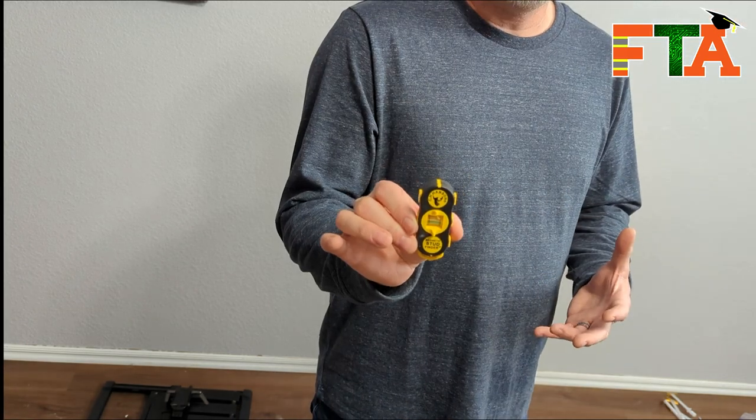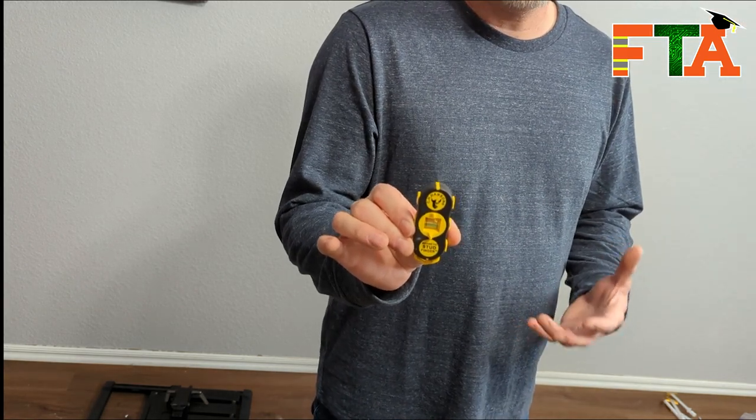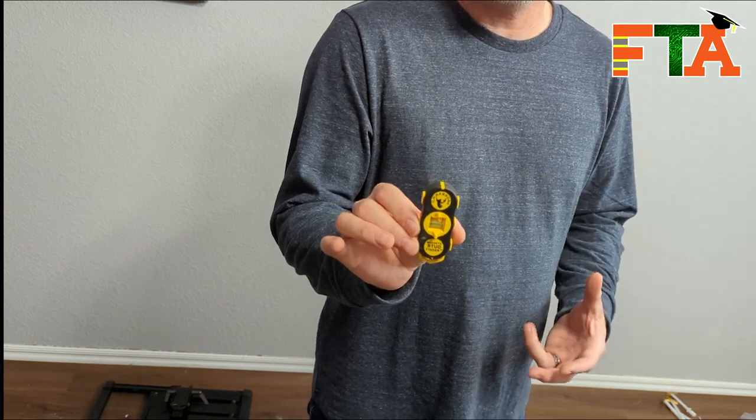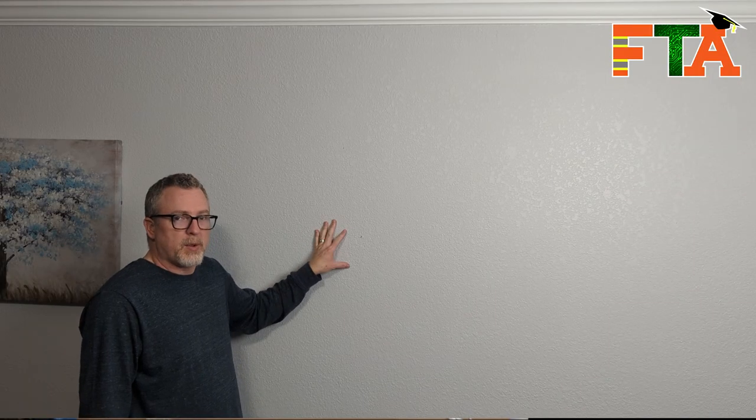So this is a very simple device that I've found. Got this on Amazon. I'll put a link to it in the description. It is a rare earth magnet stud finder. You've got some sort of stud behind this drywall, and the drywall is attached to the stud with nails or screws. That's where the magnetic stud finder comes into play.